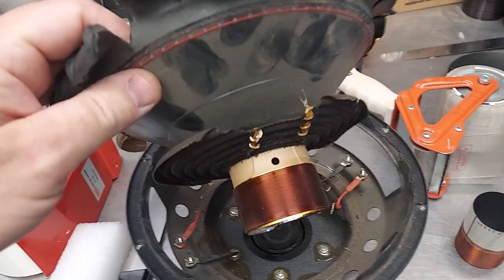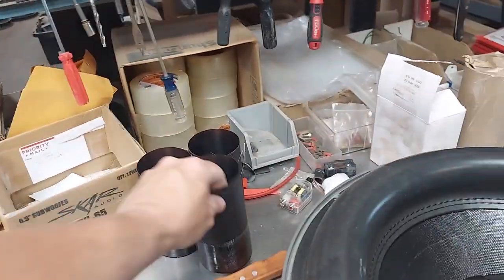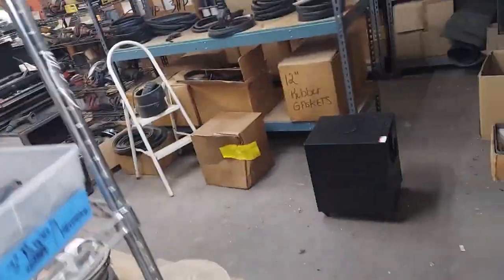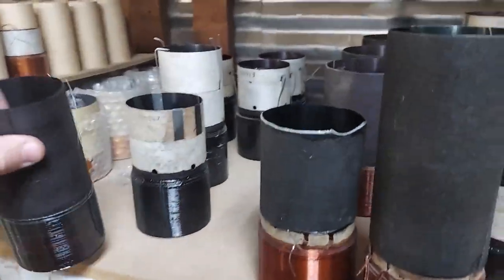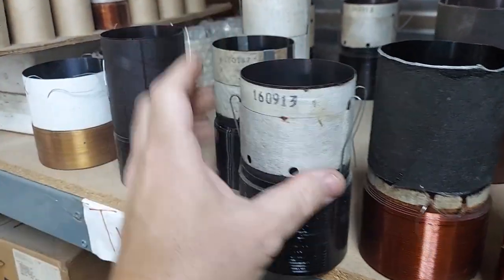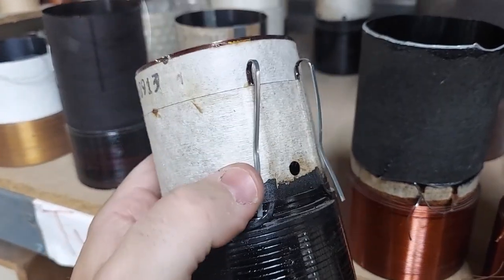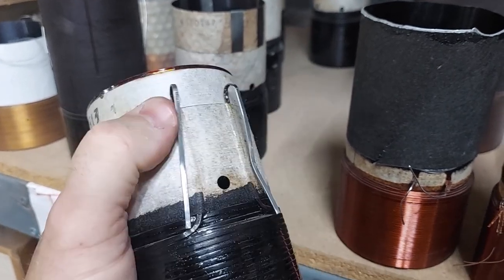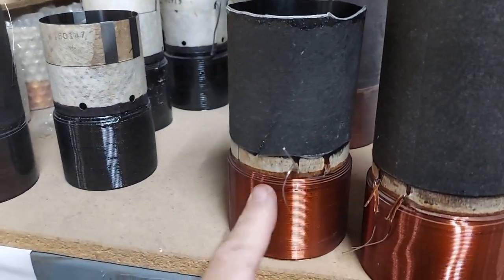So that's medium, small, and large windings. And if you go bigger — here's the Slim Jim copper flat wire — flat versus round doesn't matter, that has to do with just fitting the dimensions of the gap. That's why it's best to design the coil first and then design the gap after. This is the dual 0.25 — look how big that wire is — so you actually get fewer windings, especially compared to a dual 4.